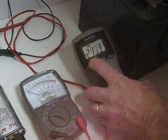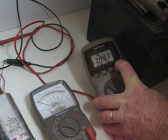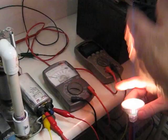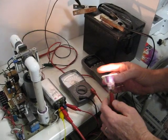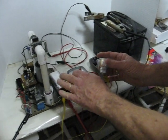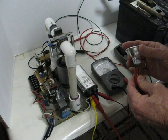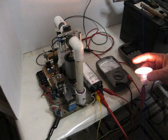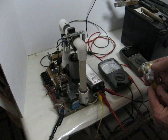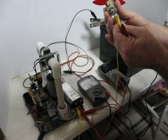There's the wattage — I got it hooked up backwards, don't worry about it. The readings are fluctuating between about 2 and 8 amps. This is a 11,000 RPM, 12-volt motor — you can't put 120 volts or more load on it because it's not made for that.